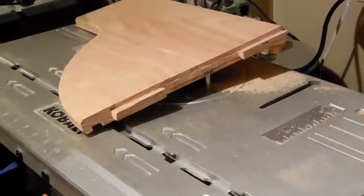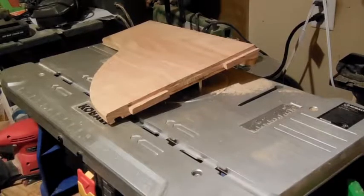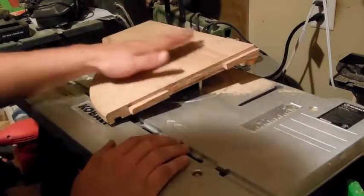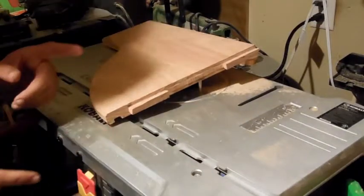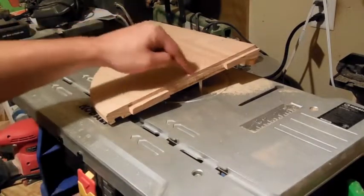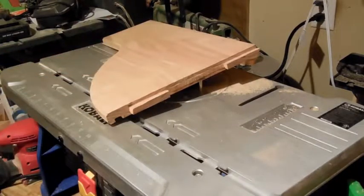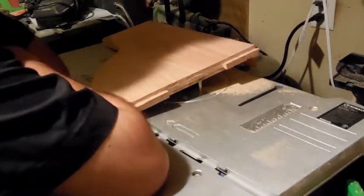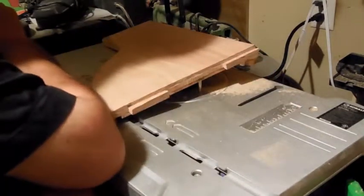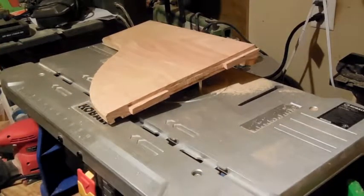If you don't have one of those, a dovetail that slides is not the best idea in the world. The only option you have if you have that kind of a problem is to use a hand plane to take some of it out. And in my case, I discovered after I had put these together, I ran one edge of these through my router to joint the edge, and then you do the other edge with the table saw. Well, I discovered afterwards that my table saw was just ever so slightly out of square. And I actually spent a good couple of hours working on my table saw to get it squared up just the way that I wanted it, because I'm kind of picky when it comes to that. So I do have an ever so slight amount of curve. I guess you would call that bow or cupping maybe.